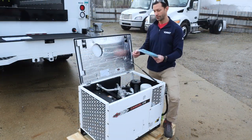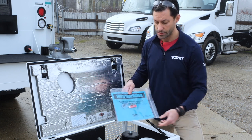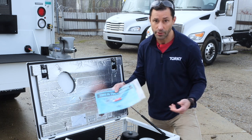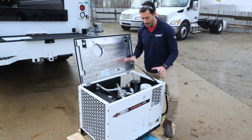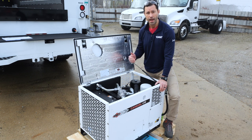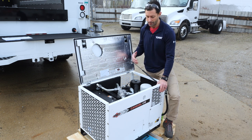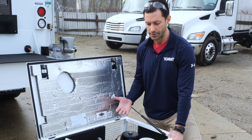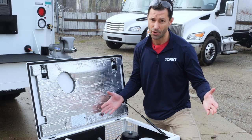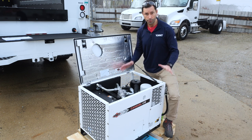Maintenance. First of all, this is your manual — it comes on a thumb drive, it's 96 pages with a lot of good useful information, and you should read it. The maintenance interval in the manual is: at 50 hours you're supposed to change the oil and filters, then every 500 hours change your oil and filters. IMT said the 50-hour service is because oil and filters can get stale if a compressor has been sitting — so if you're buying a compressor that's been on the shelf for five years, change the oil and filters.